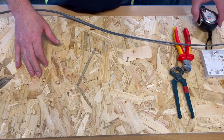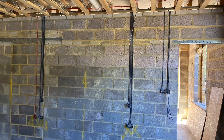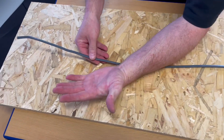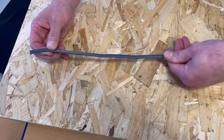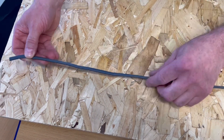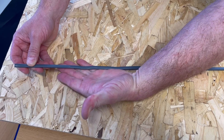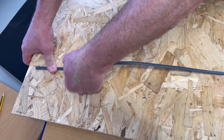Working on a wooden board gives you a few advantages over being on site - we've got a straight edge so we can work from one of our edges across with our measurements. We'll start at the top of the board, and here's the important bit: I take four fingers and a thumb and start to press the cable against the surface in order to get it to stick to the surface before I clip it.